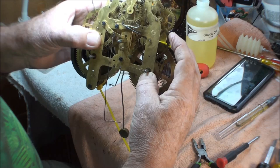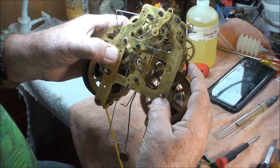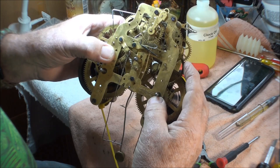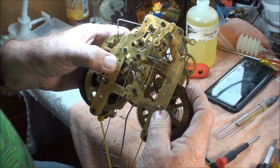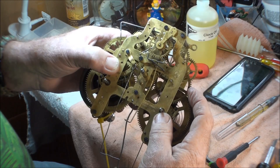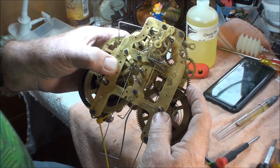I found this in Cuckoo Clocks and other clocks I've worked on. They're not happy unless they have a little bit of lubricant to push around on there to make them slide by, instead of you start hearing a skeet, skeet, skeet every time that pendulum goes back and forth. Or like I say, it'll eventually slow down and stop. But that's just my opinion. That's what I do whenever I remember to. Make sure it's lubed up just a little bit.